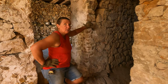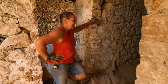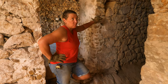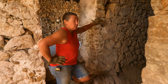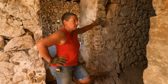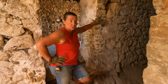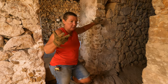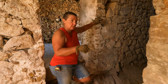Okay, you want to talk to me about some of our grey water pipe here? Maybe we should start with what we mean by grey water in case anyone's not familiar with the term. Sure. That's an easy one. So grey water is anything except what you flush down the toilet, in my mind, because toilet is black water. So into our grey water system, we have chosen to connect the kitchen. That means the kitchen sink, the dishwasher, the laundry sink and the washing machine, and then anything that comes out of the upstairs bathroom, which will be a bath, a shower, a sink. And then downstairs we will have a sink and a toilet, so we will connect the sink as well.